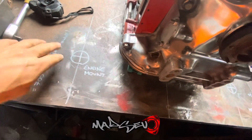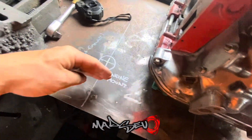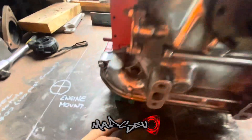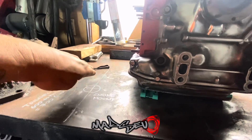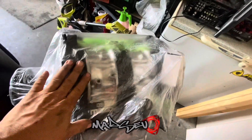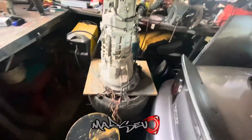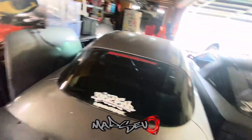I've actually been sent some photos of some rough dimensions, so from what I can tell, I'm able to pinpoint that the factory engine mounts are here and here, and I've just put this block here in relation to that. I should be able to make a bracket that comes down and mounts to these points. The only issue is I don't know the height of these mounts or the angle, so I'm going to drop this engine off to them now. This is the engine going in the car — I'll run a laser down to get all the dimensions I need, as well as dimensions to mount this gearbox.